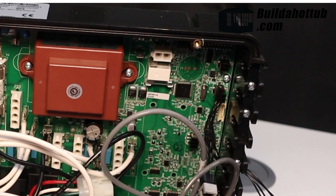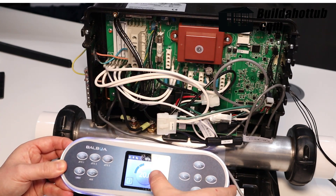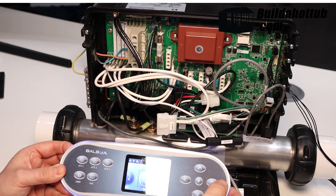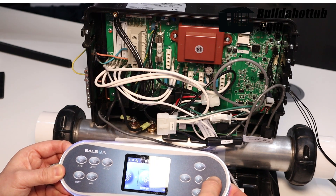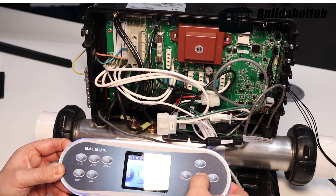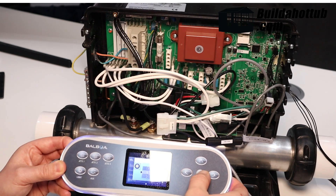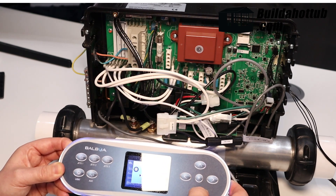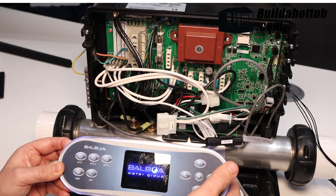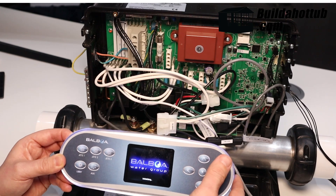In test mode, or setup mode, I've got access via the keypad control to a different menu, and I can change the software setup. I love these graphical user interfaces — they're very, very nice. I'm going to navigate to my test option, which doesn't exist when dip switch one is down — I'll show that at the end of the video. I'll click on test, and you can see that setup is currently set to number one. To change it, I'll just scroll down and set it to number nine. Click set, and you hear the relays click.